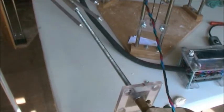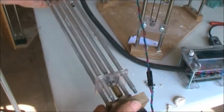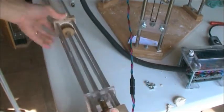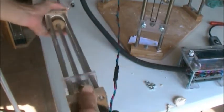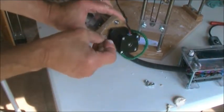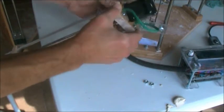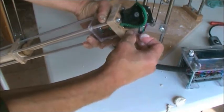The structure of the container needs to be pretty solid and quite straight because the amount of pressure it's under is quite immense. The stepper motor has a 1 to 27 gearbox on it, and extending out of the motor is a threaded rod. On that rod is a little nut, which presses up against a plastic plate that slowly pushes the plunger down into the cartridge.